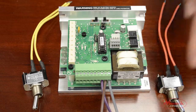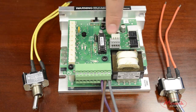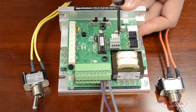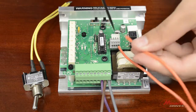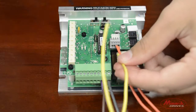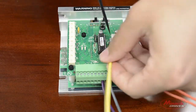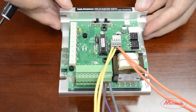Next we'll be wiring up the inhibit switch and the enable switch. These go into the terminal block right here in the middle of the drive. You can use a screwdriver to open it up. The inhibit goes on the right-hand side while the enable goes on the left, like so.